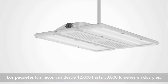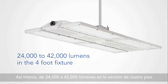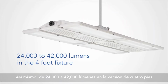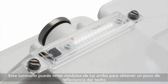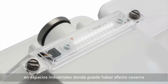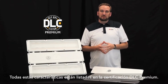Lumen packages for the XIB are from 12,000 lumens to 30,000 lumens in the 2-foot that you see here, or 24,000 lumens to 42,000 lumens in the 4-foot version. Additionally, this product's available with uplight modules to get a little bit more reflectance off the ceiling in industrial spaces that typically have that cavern effect. And all these different combinations come together for a DLC Premium listing.